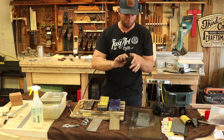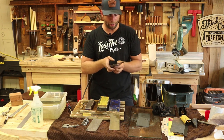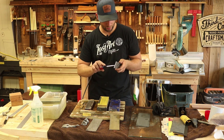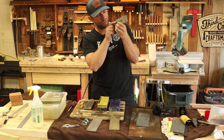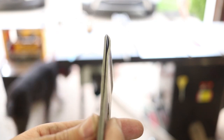Now we're going to talk about the chip breaker, or cap iron as some people call it. These are important to also sharpen and tune to your blade — if they aren't properly set up, your plane blade is not going to work as well. I'm going to put these together, bring this up to where I'd normally be using it, look between the plane blade and the cap iron with some light, and check for any gaps. There's a big gap on one side. Now when you put this in the plane and cinch down the lever cap, that'll squeeze and essentially eliminate the gap — but we're going to flatten it anyway.